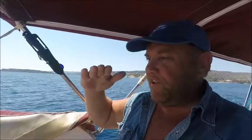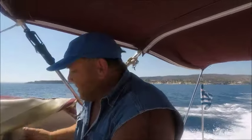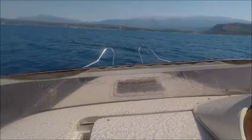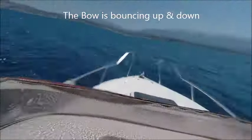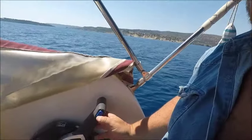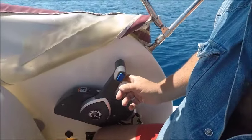One other important thing: if the boat is porpoising like this, you're going whoosh, whoosh, whoosh. Okay, we're going to porpoise now. We're going to send the engine up so we naturally porpoise. Gradually lower the engine. So you just use little second bursts like this, little burst like that, okay? See? That's all you do.